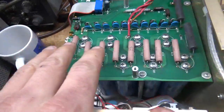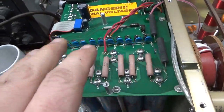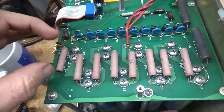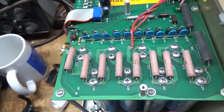I'm going to take out these pink resistors. All the caps are good — I've fired it up and the plate comes up. I'm going to change those resistors because when one of these fails, it causes the cap to fail. Ameritron still doesn't have the black ones, which are the newer type. These pink ones are more prone to failure and don't last as long as the black ones.